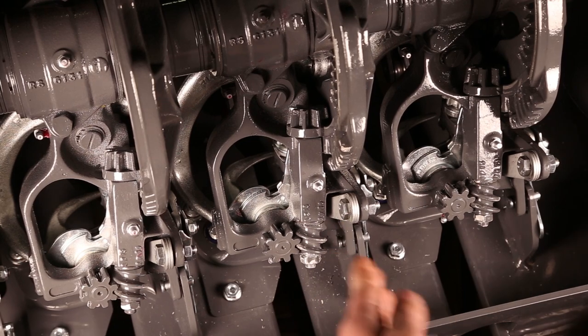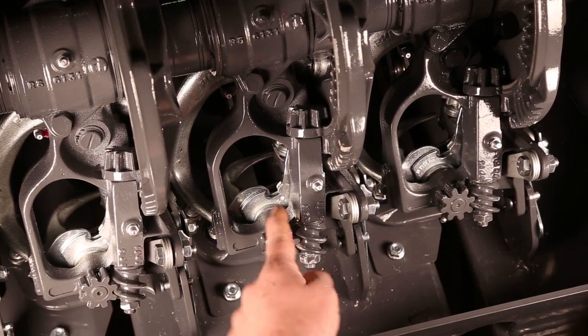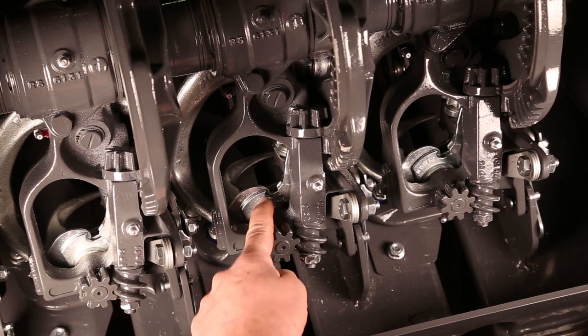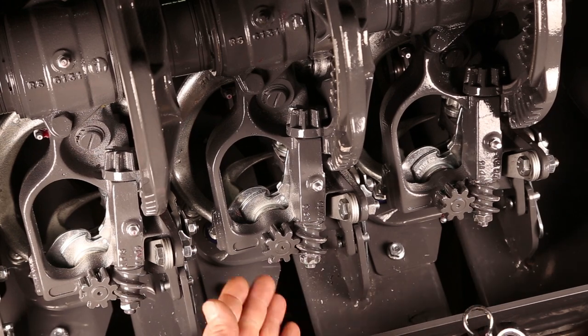Basically, this spring reaches down through, putting pressure against this cast piece, rotating it towards the twine disc. So when twine's in there, it dictates how much twine can slide through as the knot's being developed.